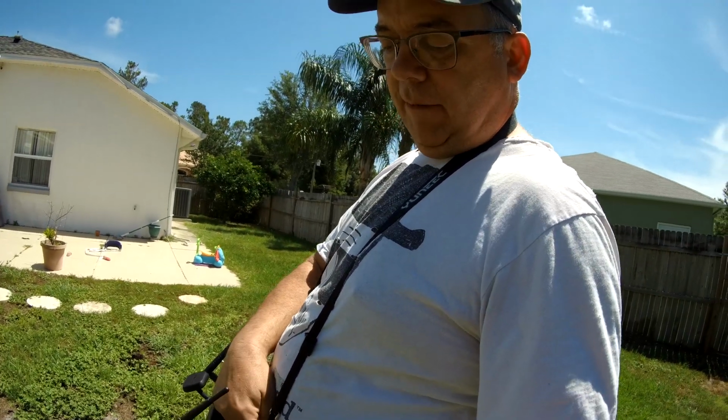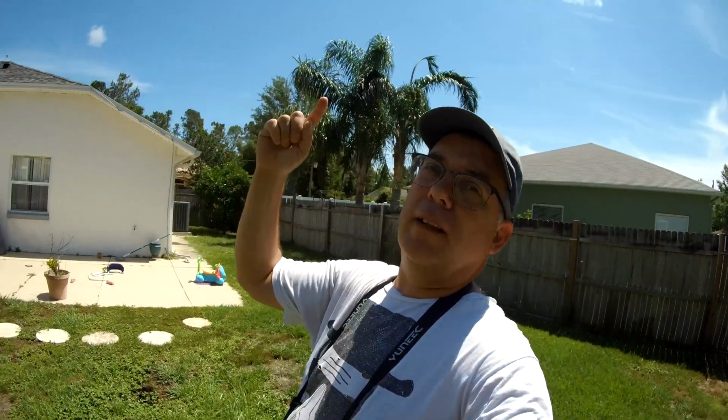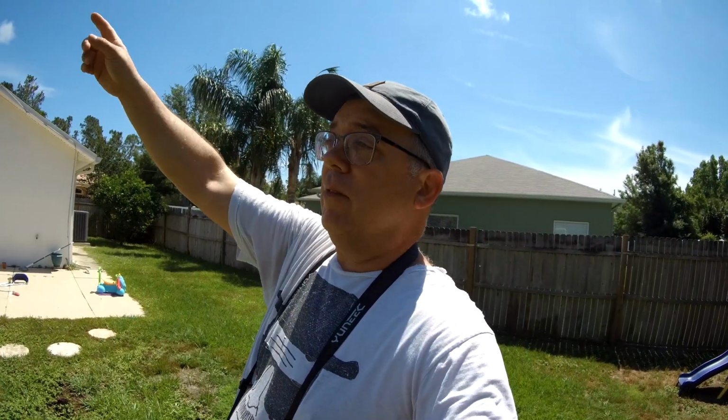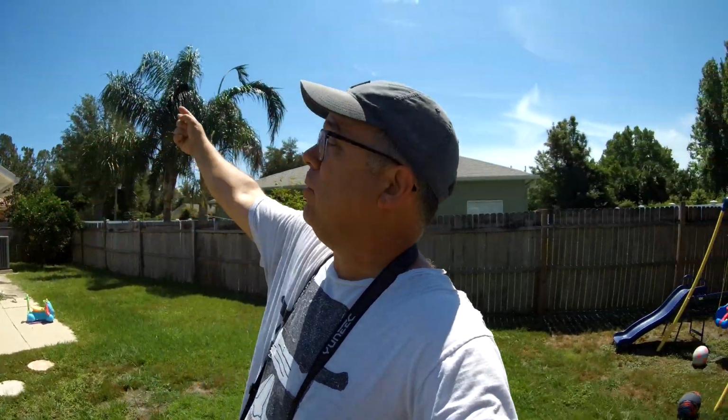Then I went backwards, because if you push the stick forward, it's going forward along the cam line. If you pull it back, it goes backward. So basically you can just go forward, and then when you get to the end, you can click backward and start going backwards. Or you can set a cam mode to fly way out somewhere else, like fly way away from you, and then start the program and click backwards and it'll backtrack along the path back to the original point. So you know you're not going to hit something.